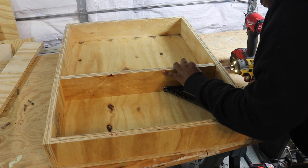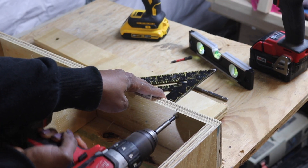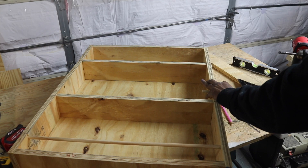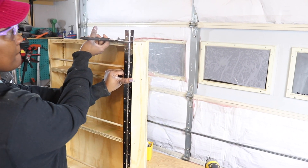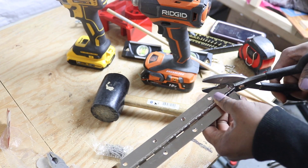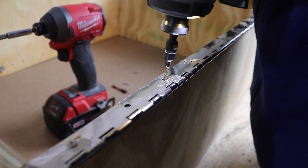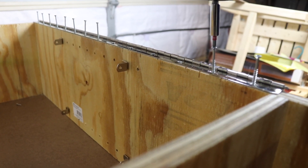The door height is 28 and a half inches, which gave me room for two 10-inch high shelves — enough space to store two rows of full-size spray cans. I inserted a three-eighth inch wooden dowel about two inches above each shelf to keep the spray cans in place as I opened and closed the doors. Then I cut the hinges to the height of the door, clipped the edges at the top and bottom, pre-drilled the holes, and screwed the hinges in place using a longer screw. Then I attached the door to the base of the cabinet while it was already hung.